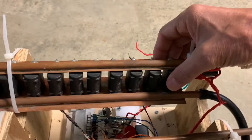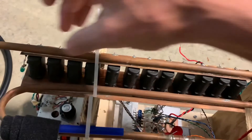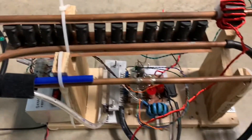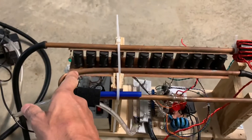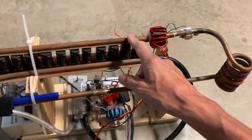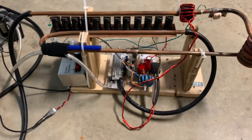One other thing you'll notice if you do make this: these resonant caps. I have a total of 4 microfarads of resonant caps here, and they get hot. You want to distribute the amount of energy equally between all the caps. That's why the lower part of the coil is coming off this end of the cap bank and the upper part of the coil is coming off the other end of the cap bank — so they're getting spread out in terms of the way they're being used.